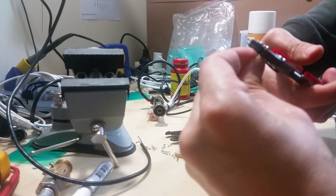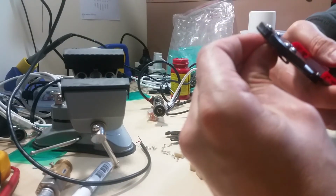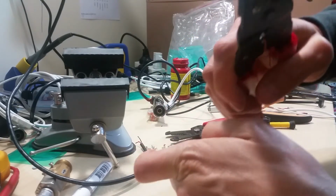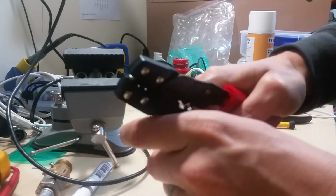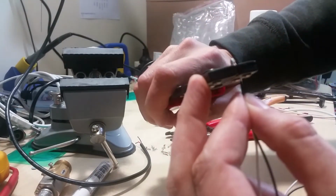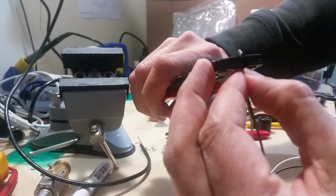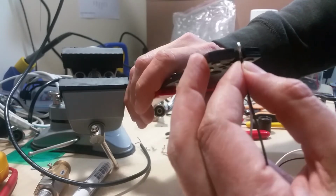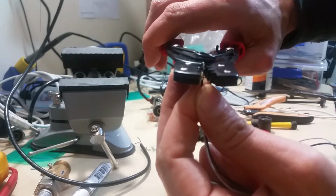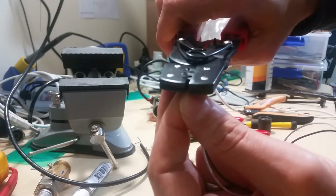But first thing to do, orient your hand, like put them into the nose of the pliers. This is not where you're going to crimp them finely, put them into the nose of the pliers like this and just barely hold them. And then from the top here, while you still see it, you can lay the wire down into the gap and get it perfectly positioned, and then just give it a slight squeeze until it grabs it. And once it's grabbed, you can actually feed it into this slot here. And then crimp it.